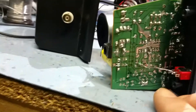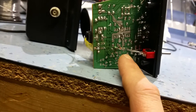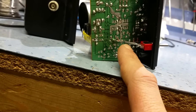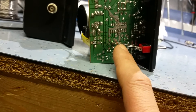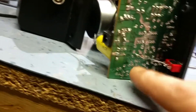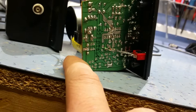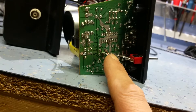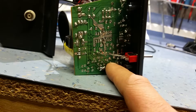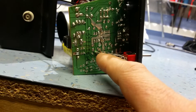What I've done here is added an extra switch for a diode detector. Initially I was going to put the diode right at the front end, but the trouble with that is the diode could see quite high voltage. If I'm probing around in valve equipment, there's a good chance that the diode will see big spikes of voltage. And because they're a germanium diode, they're very sensitive. So what I've actually done is put this diode after all the extra balancing and capacitors on the front end of the amplifier — right on the input of the op amp.